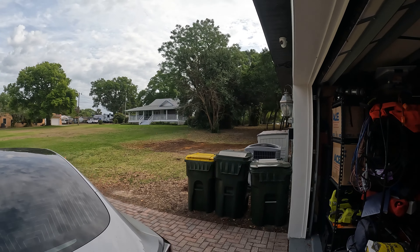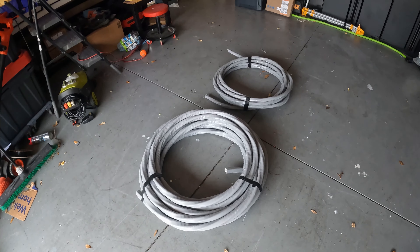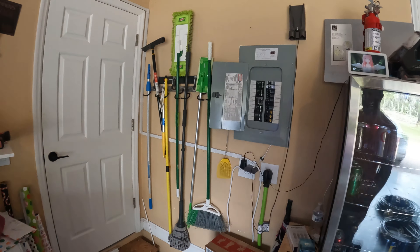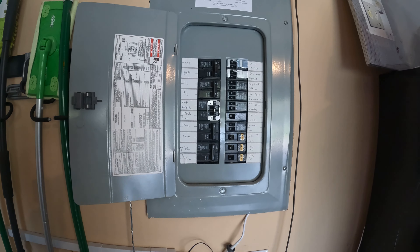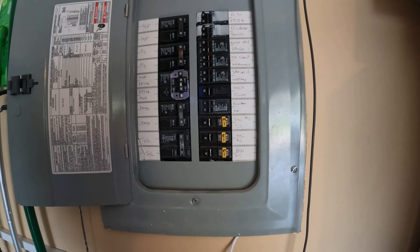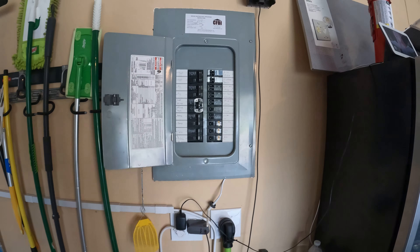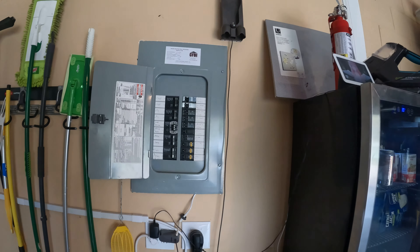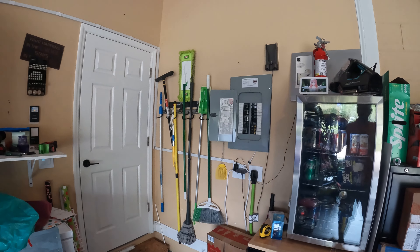Part of the preparation is running some new cable for this house. We just bought it a few months ago and it came with this tiny little breaker panel — this is the main breaker for the whole house. As you can see, there are lots of double breakers just to get them all to fit. It's completely tapped out in terms of size, and also in terms of capacity. It's a 150 amp panel with a 150 amp breaker on the other side of the house where the power comes in.